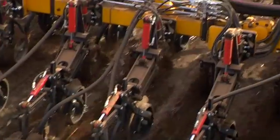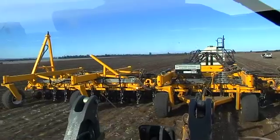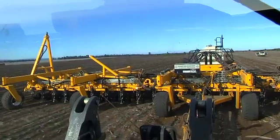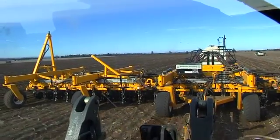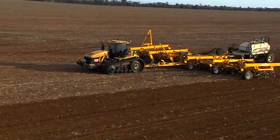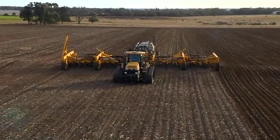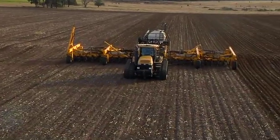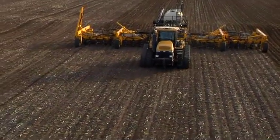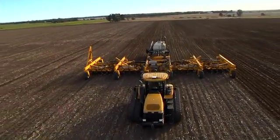What we need to be able to do is not only have the flexibility of going from a cultivating mode to a no-till seeding mode with a tine — we also need to go from a no-till seeding mode with a tine to a no-till seeding mode with a disc. Without the use of a spanner, you can simply take one tine assembly out and put the disc assembly in. We also have a range of different press wheels, because at the end of the day the real secret to accurate germination and yield improvement is through seed-soil contact.